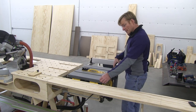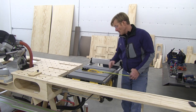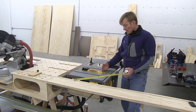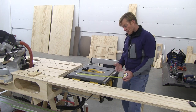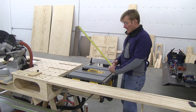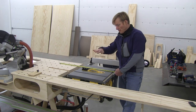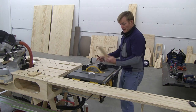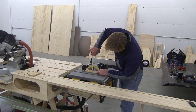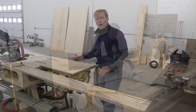I'm going to make it about the width of the saw, which is around 22 and a half to 23 inches. If I made it just the front-to-back width of the table, when I pulled it back to have the blade clear the material there's a possibility it gets back in here. I want it to rest on the saw with the blade in it and still have room to set up my cut. I want it to cut all the way through at maximum blade height. With a three-quarter base the tallest cut would be close to two and a half inches, but with a half-inch base I could get to two and three-quarter inches. I'm using AC plywood.